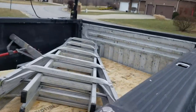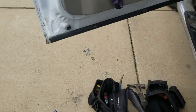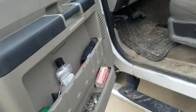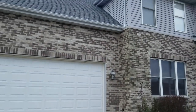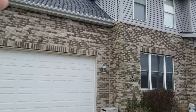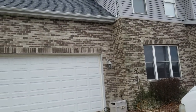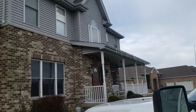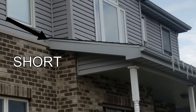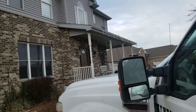You're going to need shingles, which we have in here on the backside of the car. These are IKOs — not a shingle I like to install. This is just a repair and it's what was put up there. It's pretty sad — they've replaced this roof twice now, and you'll see in the repair how terrible of an install they're getting. Just look at that drip edge — why put white on gray drip edge? It's crazy.